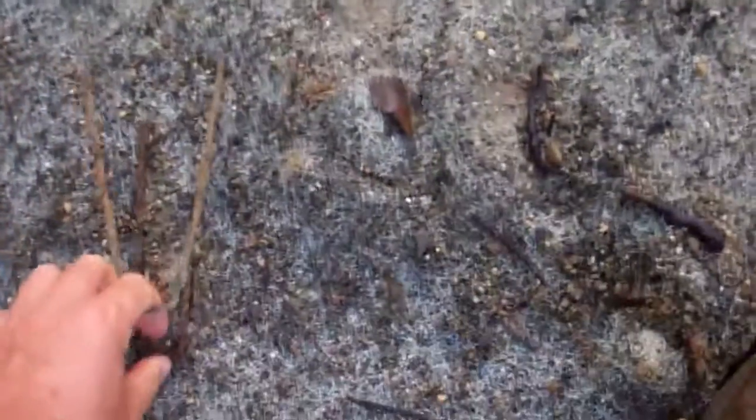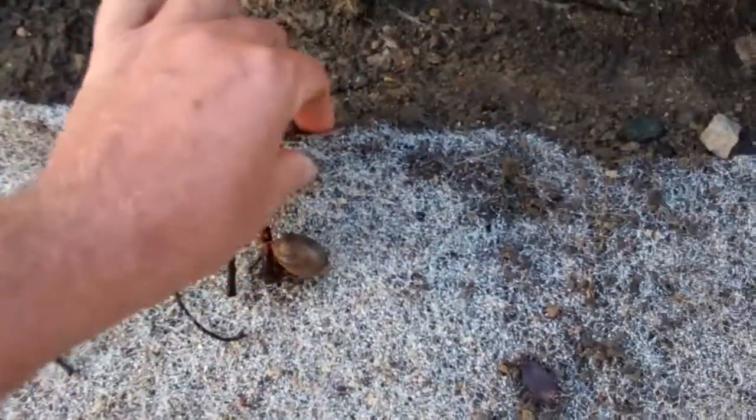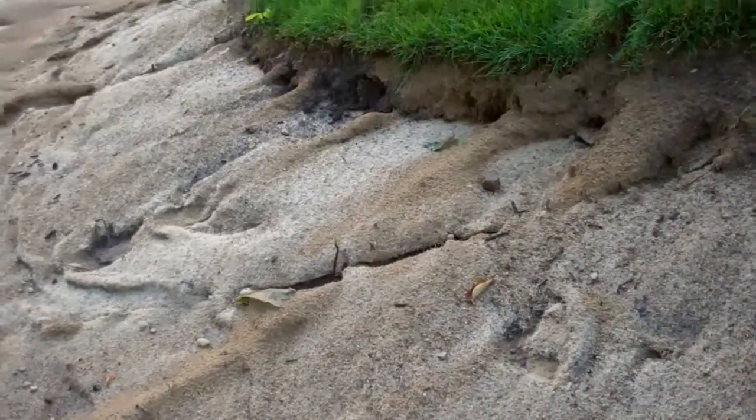If you don't put your foot down next to it, the fabric tends to pull up with it. You've now broken that adhesion from the fabric to the soil. What we found is the staples are generally temporary — once the fabric's in the ground for a while, it kind of intertwines with the clay base, and it takes a lot to really dislodge the fabric with water coming up from underneath it. There's a better staple out there than these metal ones. If you do have the metal ones, simply pull them out — don't push them back in, because they'll just come out the following year and become problematic.